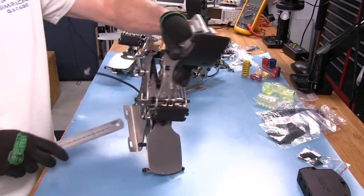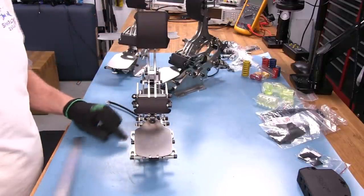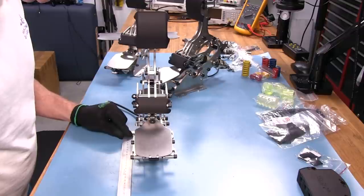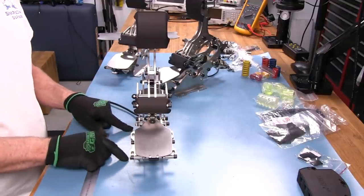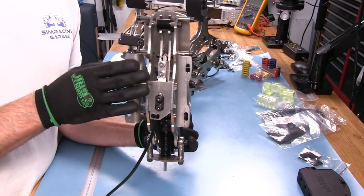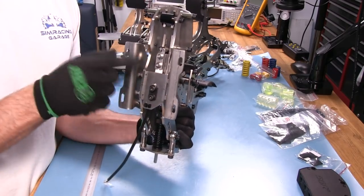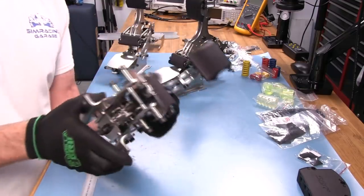And the flanges down here have some mounting slots in them, and the flange itself is 110 millimeters long. The centers on these slots come in at about 78 millimeters. And I'm trying to push this back to where I could imagine the center of an M6 bolt would be, and that looks to be about 83 millimeters maximum spread here. This flange was made to fit on a 40 series 120 piece of profile, the one that has the three channels in it, so it'll fit across that perfectly. Like a P1X has on their pedal plate. I think I have a piece of that that's long enough that I can use when I do the mounting, but we'll get there when we get there.